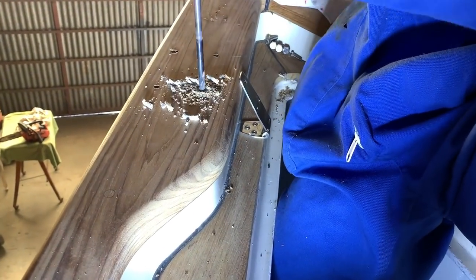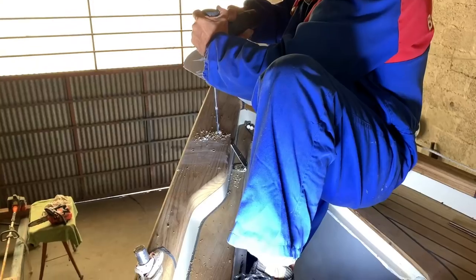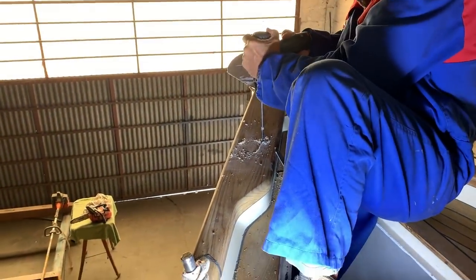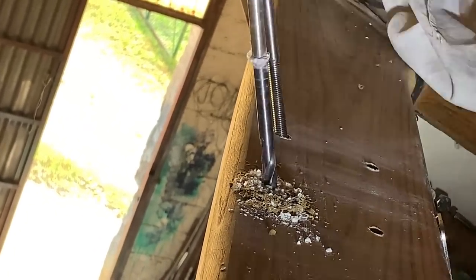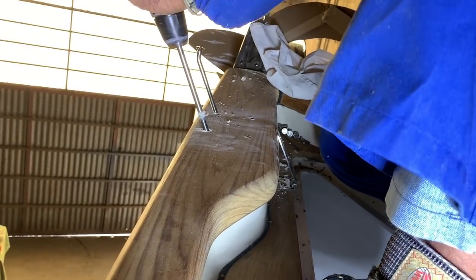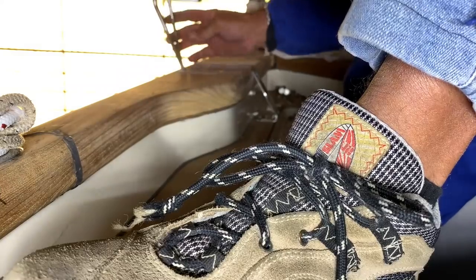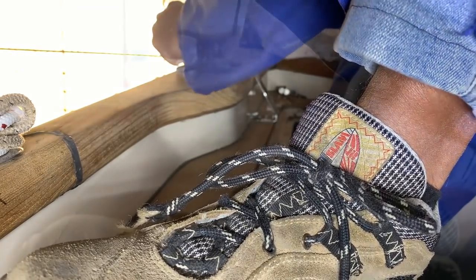Andrea is drilling the first four holes for the new cleats. Of course Albarassi made a very strong and very thick structure where the cleats are installed, so I need a very custom-made, very long drill to permit me to drill through all the thick material. You can see the bolts on the back - Andrea takes the same inclination. But you can see the bolt is bent, bent as original, to permit the cleat to stay in perfect position. It stayed for 30 years and it was nice.